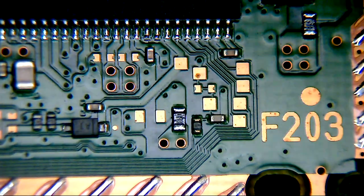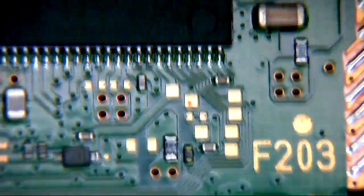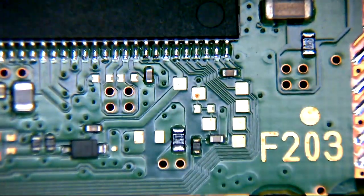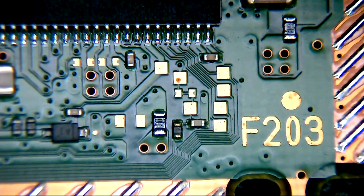One ohm and a beep. So hopefully the microphone on this picks that up. So those are the three fuses that mainly blow. You'd measure that in continuity mode on your multimeter. Some people call it beep mode, the one where it beeps when you touch the two probes together.